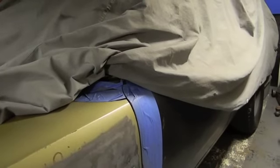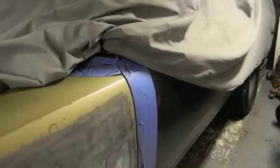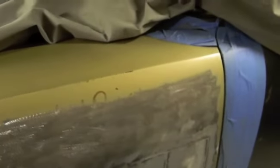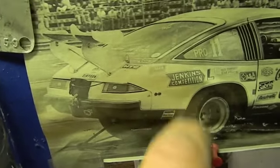I'd have something come through right underneath the bumper where you actually hook the chute. When it deploys, I'm not looking for something that's gonna stop me at 120 miles an hour — 30 miles an hour — but I'm not looking for something fake either. I'll run the handle up inside the car. I just bought it yesterday so it'll be a week before I start that project. The casing is very similar to what you see — I'd run the cable underneath the car through where the rear seat would be and up onto the transmission hump.